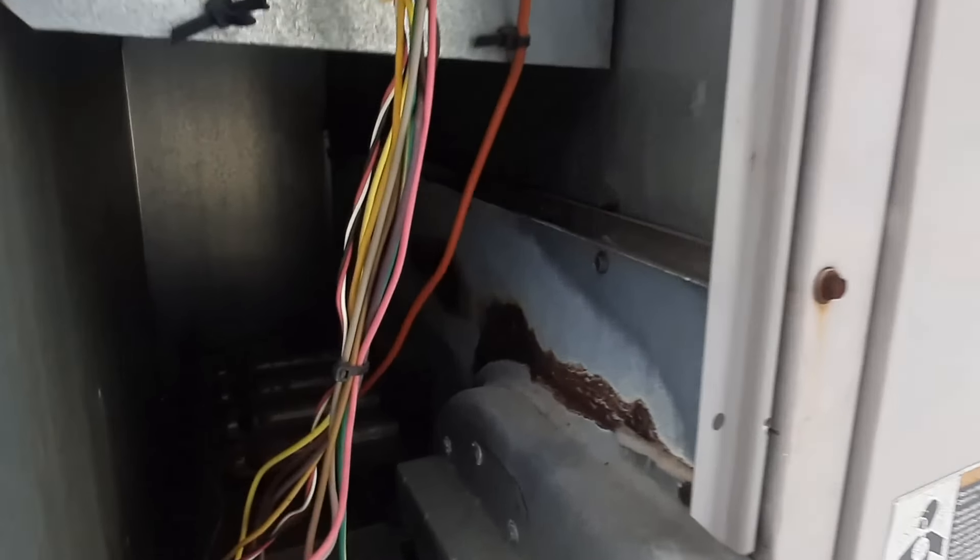Alright - we've got a direct drive blower motor, looks like it's been replaced at some point. There's a little bit of insulation damage. Filter's clean. The heat exchanger looks okay - I don't see any major cracks. But we are losing a ton of insulation and then... look at this evaporator coil. I'd say we've got an airflow issue. That's kind of what I figured. I'm going to have to pull this whole top off and try to remove the debris from the evaporator coil. The air flows through the evaporator coil last so you should get a pretty accurate supply temperature reading right here.